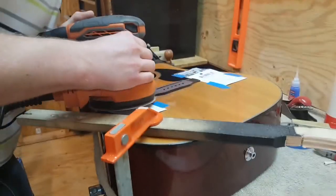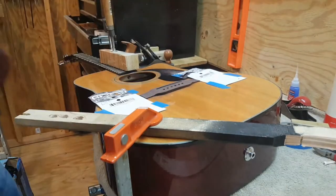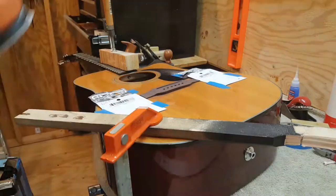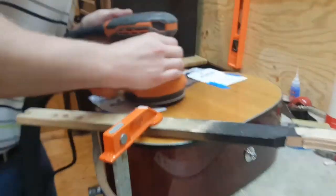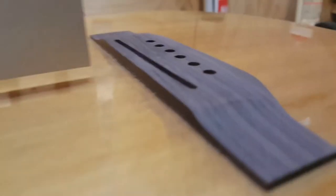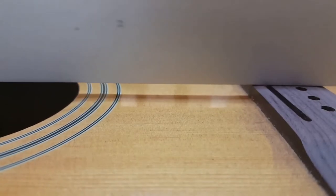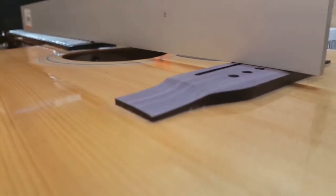I pretty well got it pretty quickly. I needed to bring down the two edge pieces so that's what I'm doing here. Unfortunately in this process the sander went through my protection and scratched up the pick guard, so I'm going to end up putting a new pick guard on as well — but that's no big deal. They retail for about $10, and at cost they're about $5. Here it is after just a couple minutes. I did go a little further with a 120 grit and finished out those wings with 120 as well, then kept moving by hand after that. You can see we're in much better shape already.